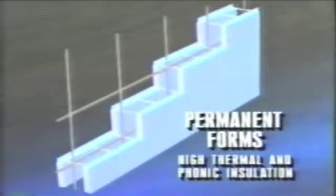The Polycrete wall is made up of polystyrene expansion type 3 prefabricated sections that can be inserted into each other. Specially designed rods allow for the desired spacing and determine the thickness of the wall. Rebar is installed between two parallel panels, forming the wall's armature. Thus, we obtain a conventional form offering the advantage of permanency, and the polystyrene prefabricated section acts as a thermal as well as phonic insulator. We then pour concrete into the structure. This is the Polycrete system.